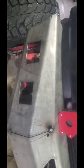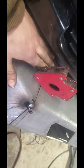After the center section, I put the right-hand side end on. I used a magnetic triangle to keep the top flush. I do have a bit of a gap down at the bottom — I'm going to try to bend it out a little before I weld it and then smooth everything with grinding after. Got both side caps on with just a couple tacks to hold everything together, and then the end caps welded on. Pretty much self-explanatory — fits together like a Lego puzzle, you just have to get your angles right.